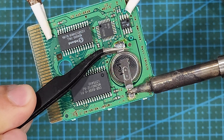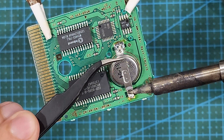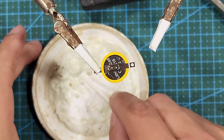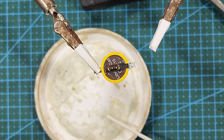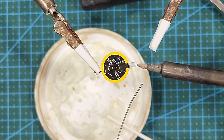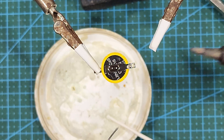I had to go back to the positive terminal as it was still barely attached. Before we attach the new battery — Game Boys use a CR-1616 battery, though CR-2025s will work, though sometimes they have fitment issues due to being just a tad bit thicker — we want to go ahead and add a little bit of flux and solder to the tabs.